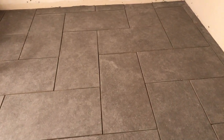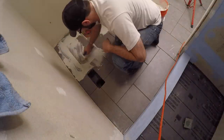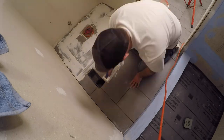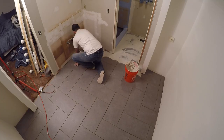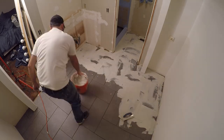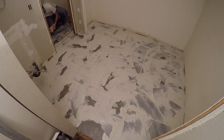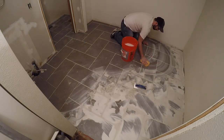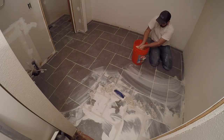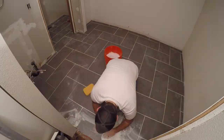This is what the tile looked like after the whole room was laid but before the grout. I started grouting in the back corner, spreading it down over the tiles — it's important to smash the grout down into the joints as much as possible. The steps are to lay down the grout into the joints with a float at a 45-degree angle, and then come back and drag the float at a 90-degree angle to remove the excess. After letting the grout set up for a little while, I came back with a bucket of warm water and a sponge to clean up any grout on top of the tile and not in the joints.